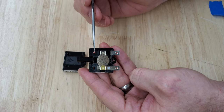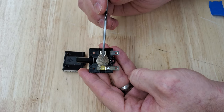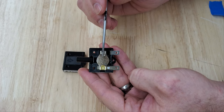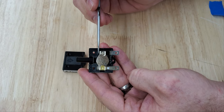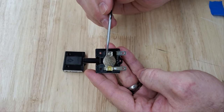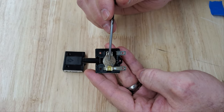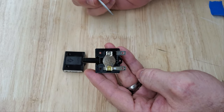I mean, you saw in the other video, maybe if you watched it, I was running about 30 amps for maybe 5 minutes or so on and off before this thing tripped. And as it happens enough, I guess this will just become a little bit more flexible and easy to make it trip. So once again, there are no electronic parts, no computer circuits that would understand what a number is. This is purely responding to heat.